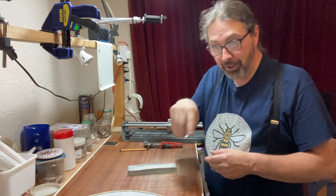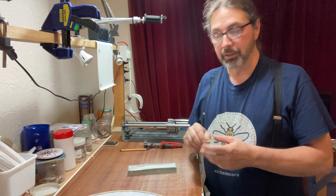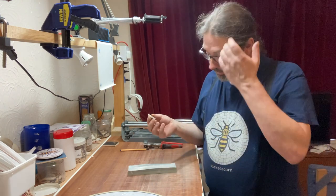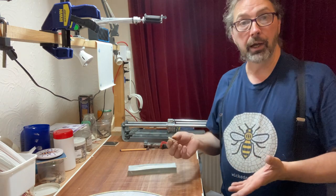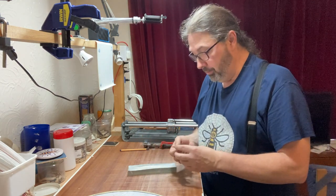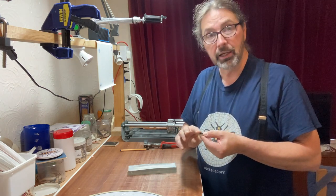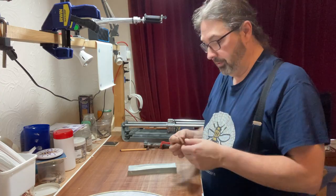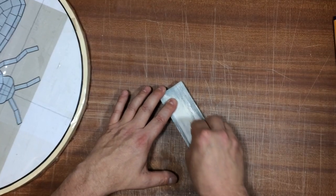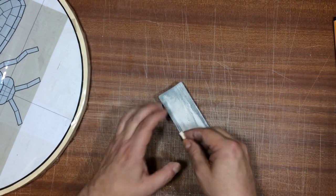You always have to cut out around the toilet and cut out around pipes and cut out around things. It's absolutely no different. And when you do cut a tile in a bathroom, for instance, you need to sand off these edges so they're not sharp. You wouldn't want a kid sliding across. So all you do is just give it a little rub like that.